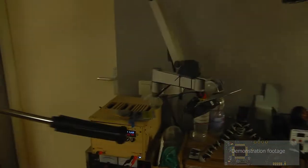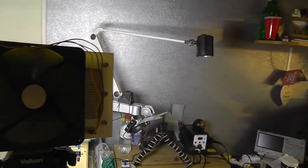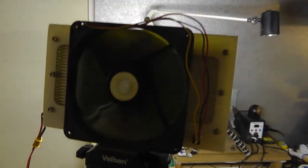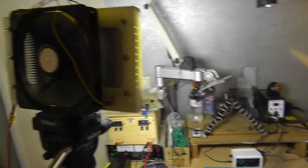I've provided links to the items in the description below. And please keep in mind that when you order the LED, you order the LED with the remote control option. They're all the same. So some listings on AliExpress, for example, tell you that they're rated for 12 amps. This is not the case. They are all rated for 6 amps, as the MOSFETs are exactly the same.